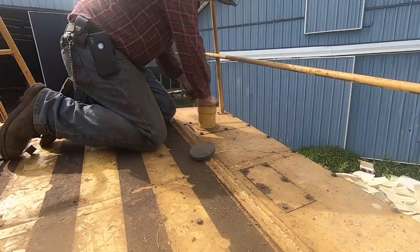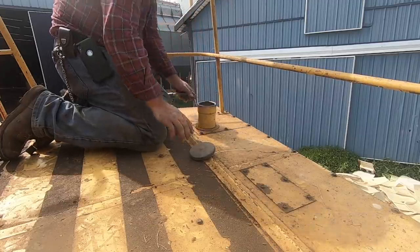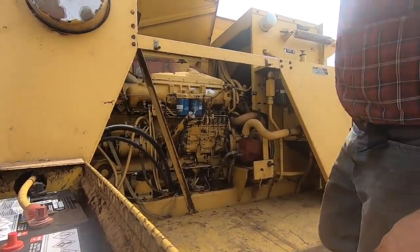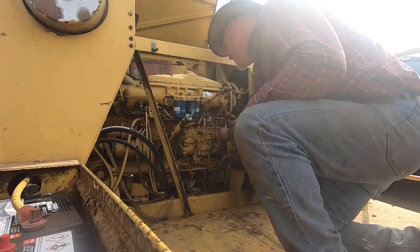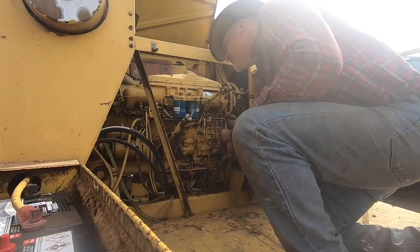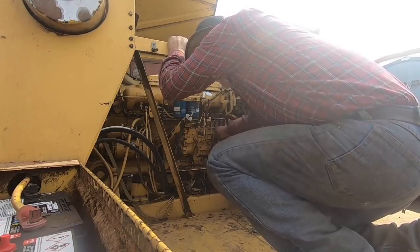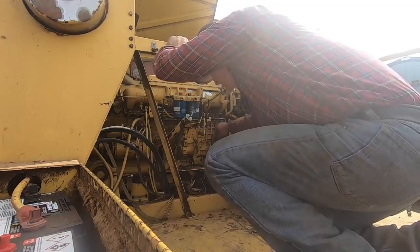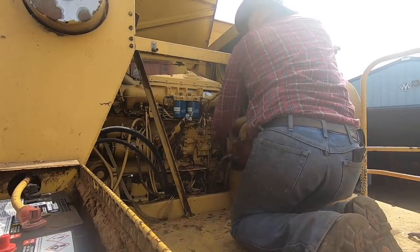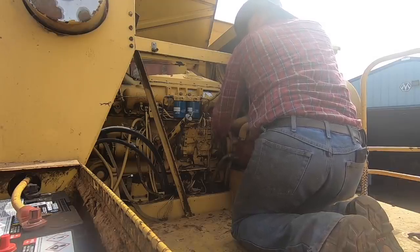I've got it off. The filter is loosened, so it's just going to have to get through there. Okay. Now I'm going to come over here. Hopefully you can see what I'm about to do. We're getting some pressure in our vacuum. Nope, it's just pumping. So it's pulling. There was a blockage at the bottom of that tank causing this thing to not want to have any fuel. Tighten that back up. It may need that in order to work. Uh-oh. I'm feeling stuff. Like I'm feeling fuel coming. Oh, there it is.